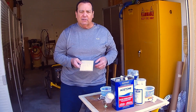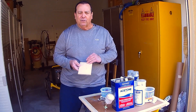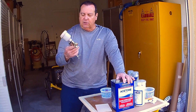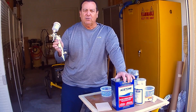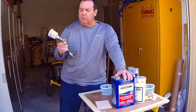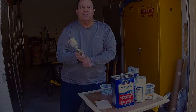The downside to these types of dyes is they have to be sprayed, because since they're acetone-based they dry very quickly — they flash off very quickly. The good thing is you can really control the absorption of the dye into the surface. We're going to do that by using a detail gun from a company called Warwick — W-A-R-W-I-C-K. It is an HVLP gun used for doing touch-up work or fine finish work, and that is what we're going to use.